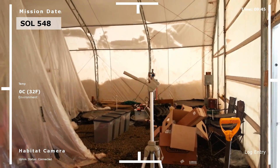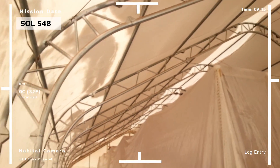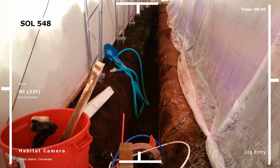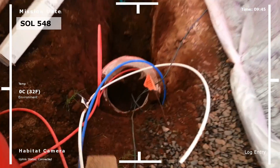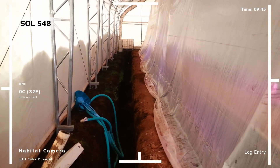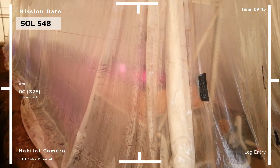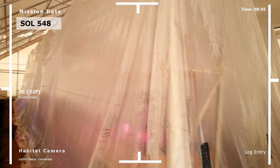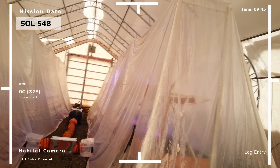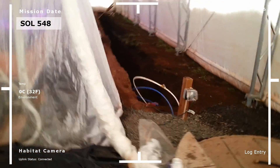You can kind of see how big the building is — that's all snow outside. The building is 80 feet long by 40 feet wide by 22 feet tall. It's a PVC covering with galvanized steel structure. This is lane one — it has not been built yet. Underneath each lane is part of the heating system. It's a radiant heating system, so we pump warm water underneath all the grow lanes. That keeps the water warm, right about 54 degrees Fahrenheit. There's lane two, lane three, and all the way over here is lane four.